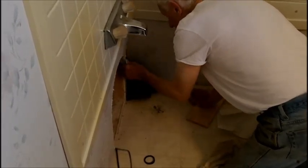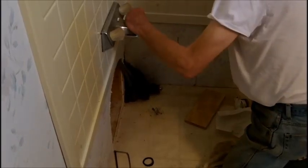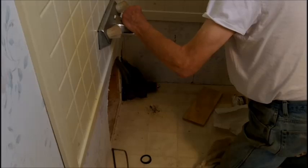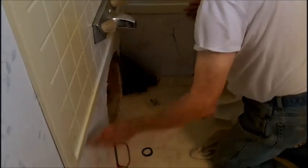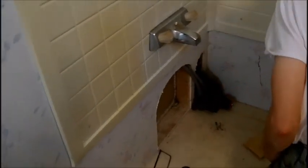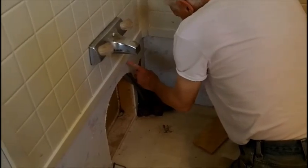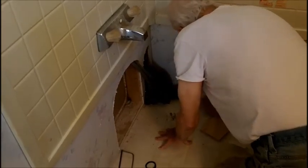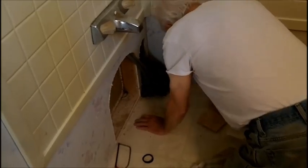what I can do, when I put the plywood here, which I had cut, I should say, it only needs to come up to here, from here over to here. So in other words, the 40 inches by 18, which is here, this side and the opposite side, and 54 here. It doesn't need to go any further than this. So what I'll have to do is box this in over here. So, all right, that's tight. Okay.